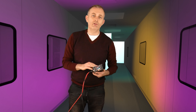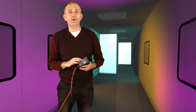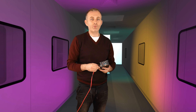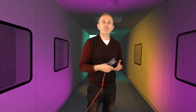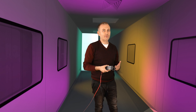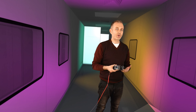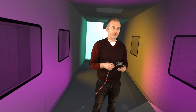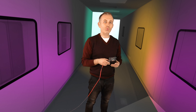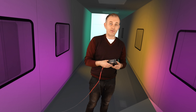This episode is entirely recorded on the Zoom F6 using a matched pair of Rode M5s just above the frame over here. No post-processing was done to the recording apart from normalizing to minus 23 LUFS. You can't clip the Zoom F6 — you just can't. It's got 32-bit recording, and that means you can record very quiet sounds and bring them back up in post, or record very loud sounds without worrying about clipping, because 32-bit saves your day.